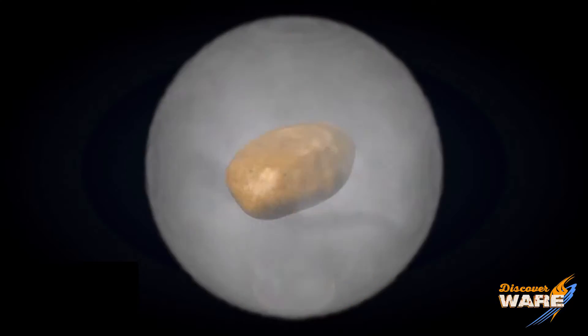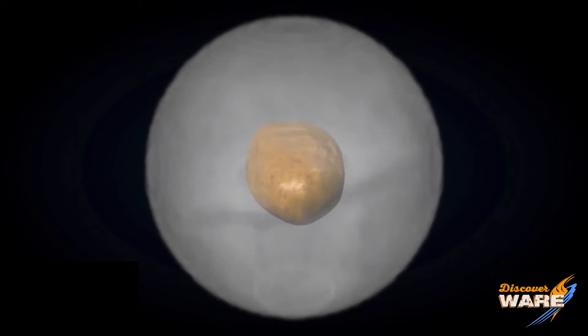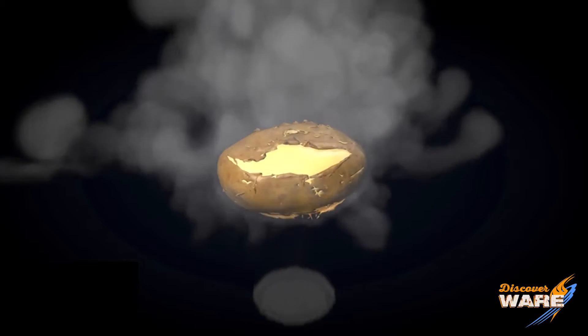Here's how it works. There's a lot of water in these guys, and they throw all these potatoes in this large vessel and hit it with high-pressure steam. Then the water inside the potato starts to boil. And then they suck all the steam out real quick, and all that water in there just expands rapidly, and it basically blows the skin off the potato.